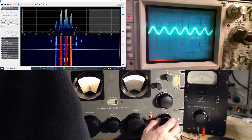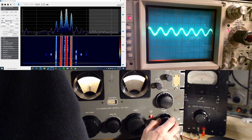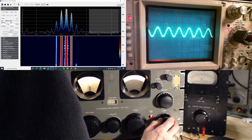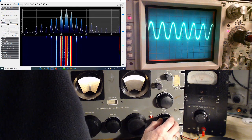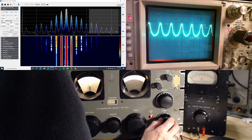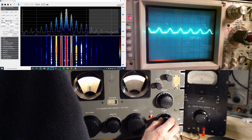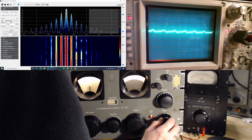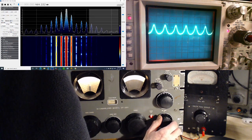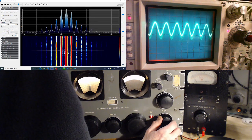So, right at the point where the distortion happens, if you look at the bottom of the sine wave, you can tell it's no longer as sharp. Even now it doesn't look quite as sharp as the top. There, you can really see it widening out. Oh, that's really distinct. You can see it's just cutting it right off. I'm just turning it up louder and louder. So there's a cutoff point and the nonlinearity starts introducing harmonics. And if we can stay below here.